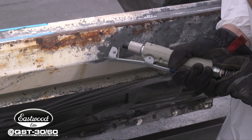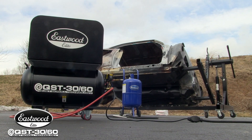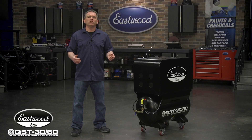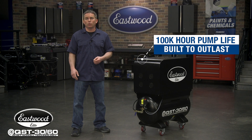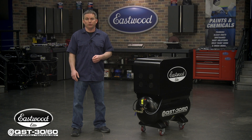This scroll is designed to run constantly and spin at about 1,750 RPM. That means you can let it run all day long and it'll put out the same PSI and CFM from the start of the day to the end of the day. They have a 100,000-hour pump life, so if you're in your shop working five days per week, eight hours per day, it would take nearly 50 years to reach 100,000 hours. And most hobbyists won't approach that much use, so basically it lasts a lifetime.